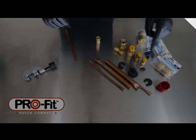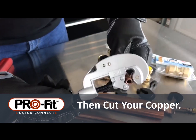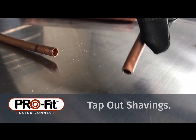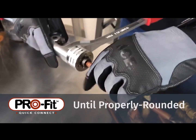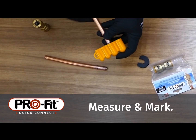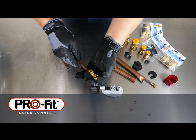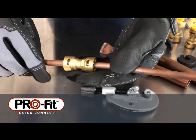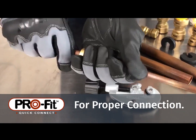Hi, my name is Miguel, and today we're going to show you how to use the ProFit Quick Connect Fittings. First, pick the right fitting for your connection — we're going to use a ⅜-inch fitting. Cut your copper, deburr the tubing, and tap out any shavings; it must be clean and free of debris. If needed, round out your copper. Grab the depth measure and mark your lines on both sides. Push the ⅜-inch Quick Connect Fitting until it's flush with your marking on both sides. To ensure proper connection, check the clear side windows — you should see the tubing; if not, push again until you do.